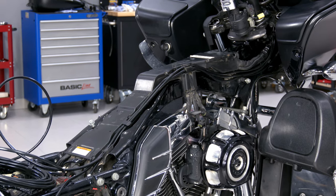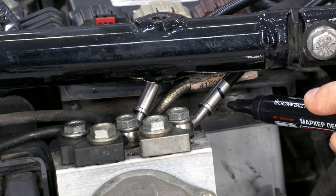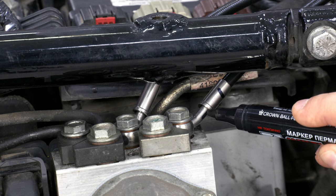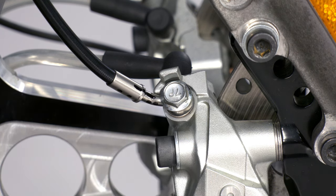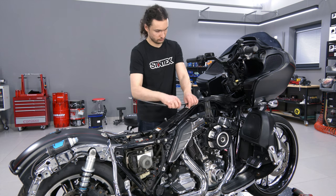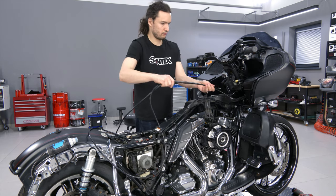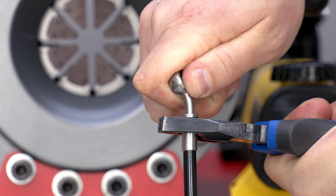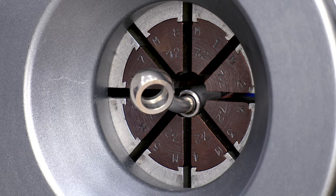After the lines are laid and fixed, you can cut them to the right length. To prevent tension in the lines after crimping, it is advisable to mark the position of the fitting relative to the sleeve. The fitting can be rotated after crimping, but it is better to fix the proper position before assembly. The sleeves are crimped in a radial press to the required diameter.